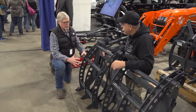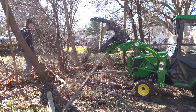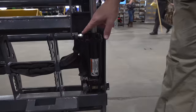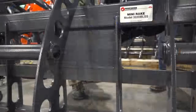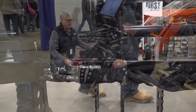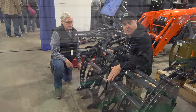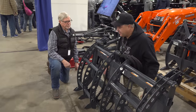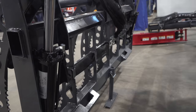Some of the features of the double grapple: of course, it'll clamp down on an uneven load, so half of your load's not going to be bouncing out of your bucket. We made this 57 inches wide so that we could have clearance in the back and still have good hose management in the rear. We put a plate to protect the hoses in the front so your fittings aren't getting knocked off. You've actually got them all hidden here — everything's clean.